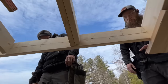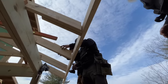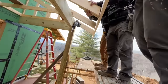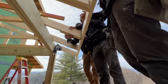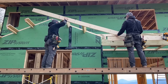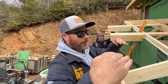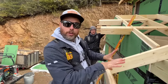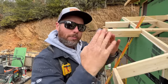We've got some blocking here to space this fascia board out to the right number because somebody cut it off an inch - that was me. I marked 21 and a half instead of 22 and a half. It was an inch short at one end. My bad, guys - you got it fixed. For our overhangs here we've got this gable end coming down to our rake fascia and they're going to connect at some point out here, and we need to figure out where that is.